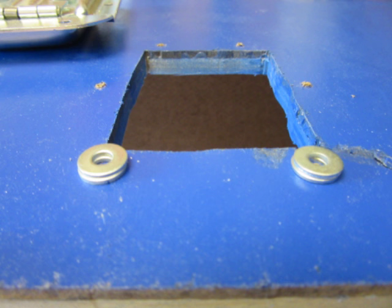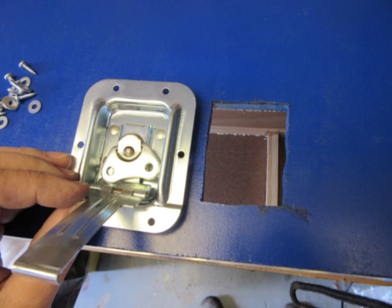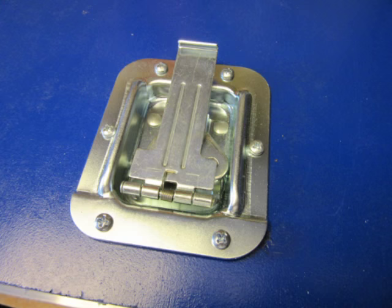I usually put a couple of small washers under it. And then, because you don't want the latches shifting under load, you make sure to select a size of screw that will completely fill the diameter of the mounting hole so that it can't shift once in place. If you use smaller hardware, it'll shift around and the latches will get loose.